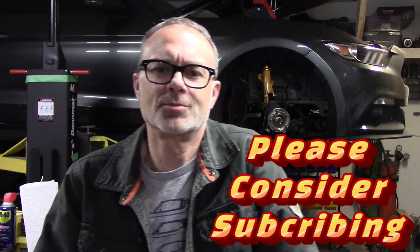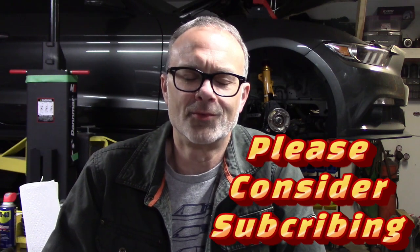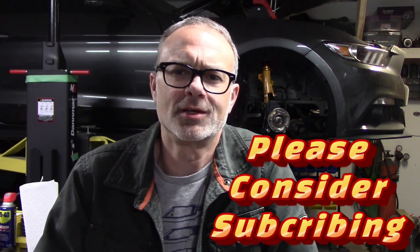Well, that's a wrap on another episode of the all-wheel drive Mustang project. Hope you found this interesting. I think what really surprised me was how much travel the CV joints are going to have. Obviously, the stock front suspension of the S550 Mustang was never intended to have a CV joint, and so they didn't design the pivot point to minimize travel if there was a CV joint in the hub. But it's going to work out.